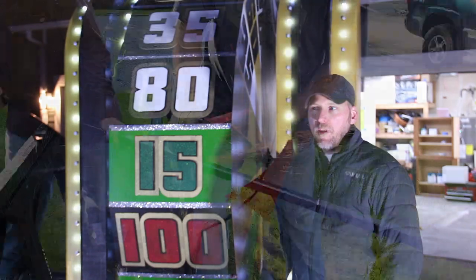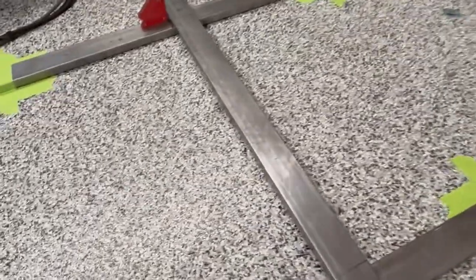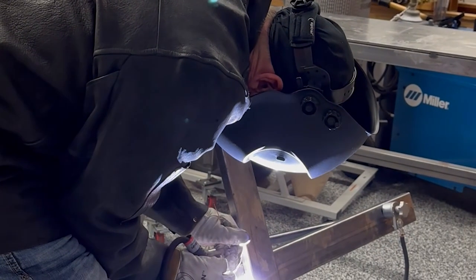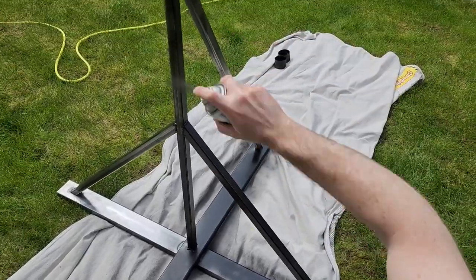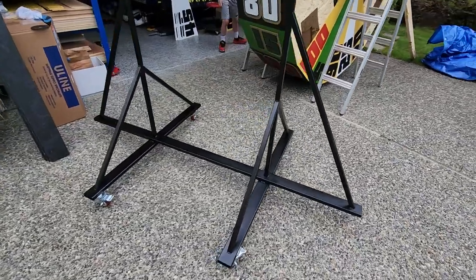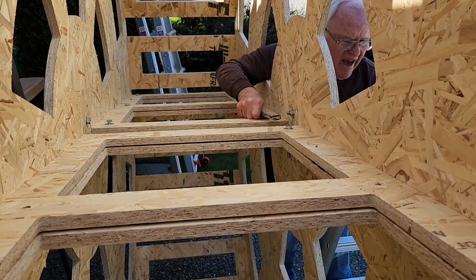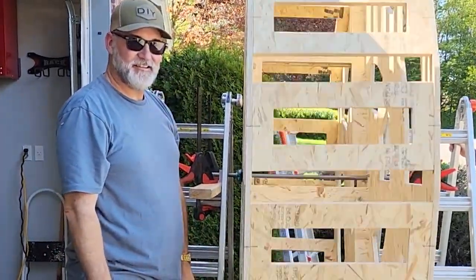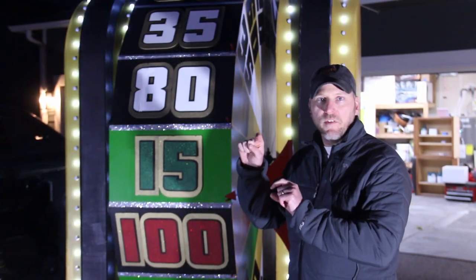So the frame was basically a cruciform, with two pieces that cross here. And then there's two knee braces on each side to give it lateral strength, so the thing doesn't tilt forward. And then I used riv nuts in the bottom to attach the casters. And you can't really see it, but there is a platform that a block sits on with a 3 foot, 3/4 inch shaft, which goes through two pillow blocks to allow it to spin. Basically a bearing with two bolts in a flange on it.